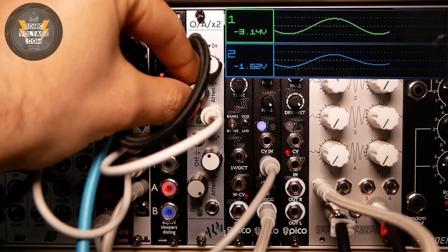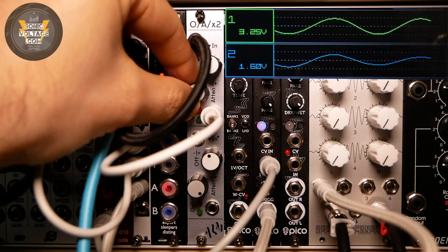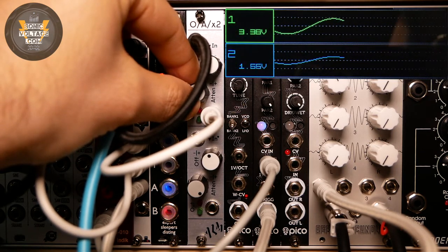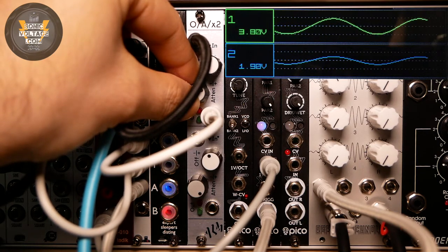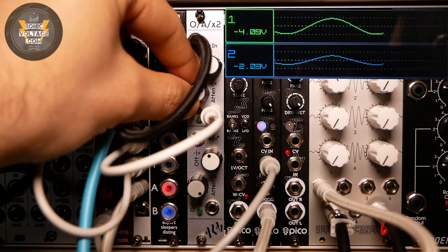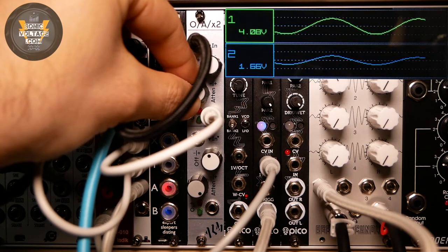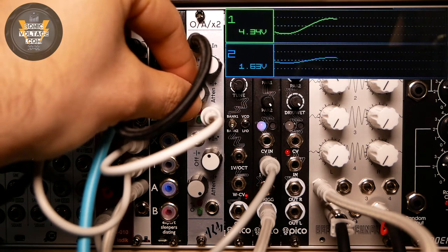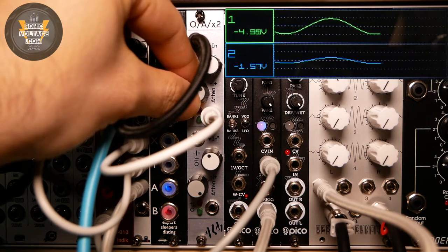You hear it now? The sound is changing because I don't have those high-pitched notes anymore. Because the sine wave voltage is not going up to 5 volts anymore. I'm attenuating to only go to around 2 or 3 volts. 2 volts. A little bit higher, a little bit lower. And you could go close to zero. But it only changes a couple of notes.